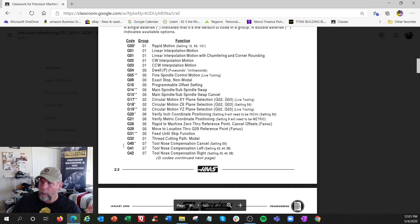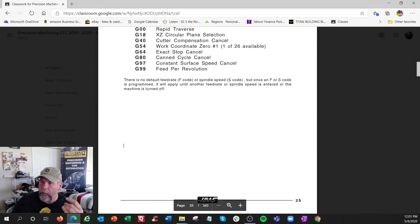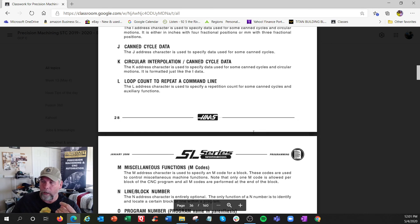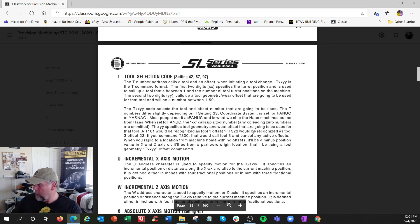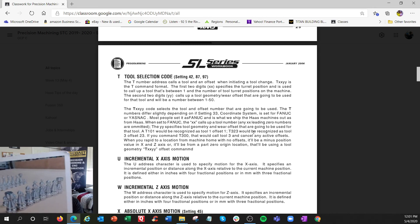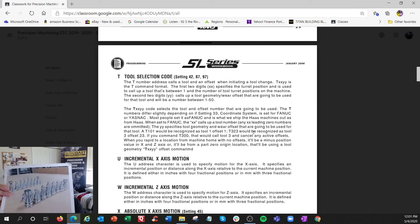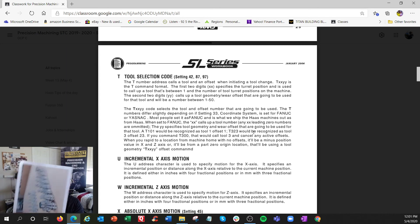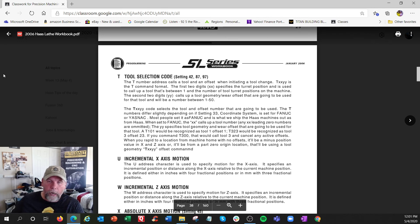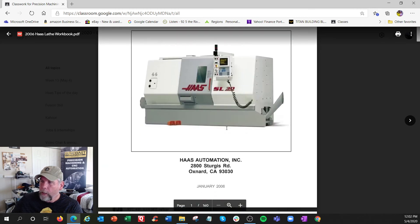So that's rough, finish, drill — pretty standard. Lathe manual programming is, I think, pretty simple and you can make a lot of parts without going to CAM. You probably couldn't make fancy lathe parts like a chess set — for that I'd be in Fusion 360. But if you have the coordinates of the profile because you're looking at them this way, that's really how it's going to be machined. The NIMS lathe project is actually killer easy.